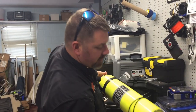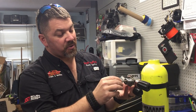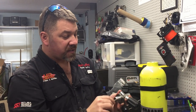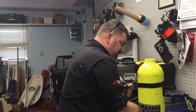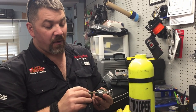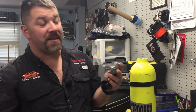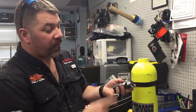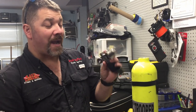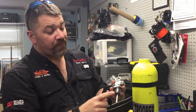As you can see his is missing, and if I turn this tank upside down and give it a little shake - there's his dip tube. So if you ever have a cylinder with a rattle in it, you're going to have some type of debris in there, but if it sounds like metal, more than likely it's this dip tube. Now if it's a newer cylinder, the good news is you can very easily just screw them back in - it's a very easy fix. We simply take an allen head and tighten it back down with just a little tiny bit of torque. If it's an older cylinder or older valve, some of the dip tubes were not replaceable, so in that case it may actually be broken off, and that's something we won't know unless we take the valve off. But that's what was causing all the rattle in his cylinder.